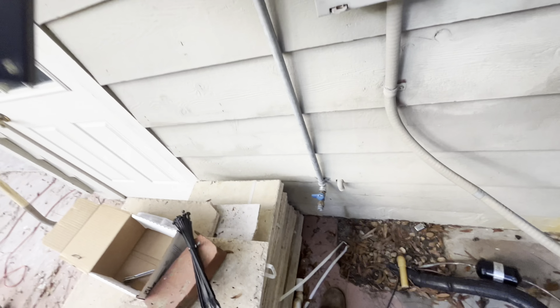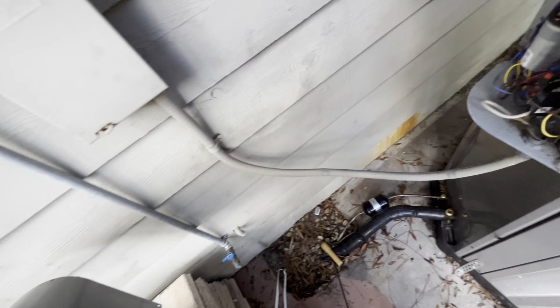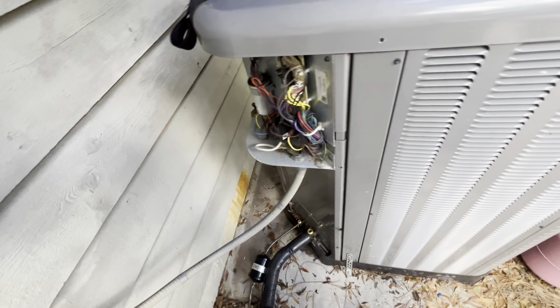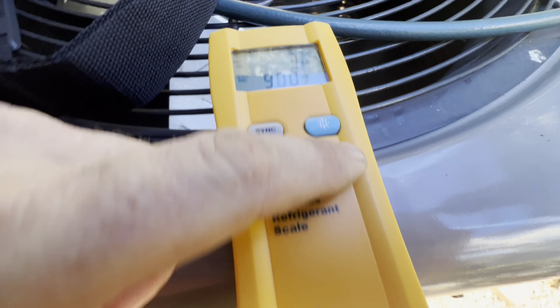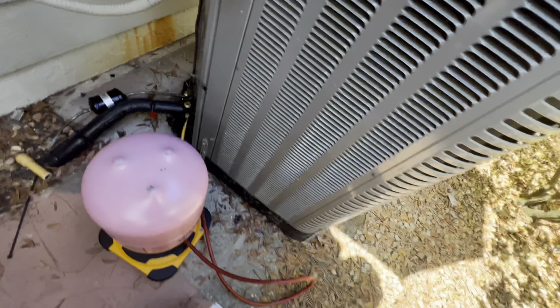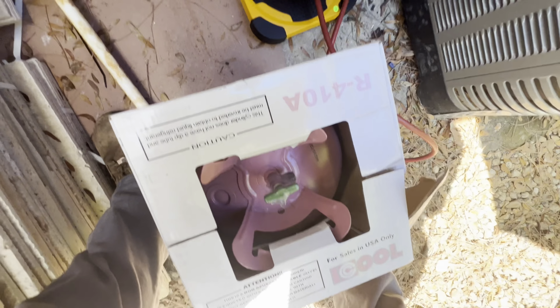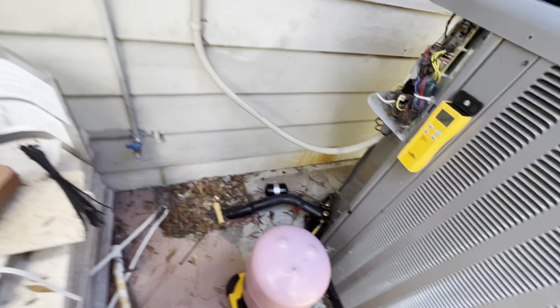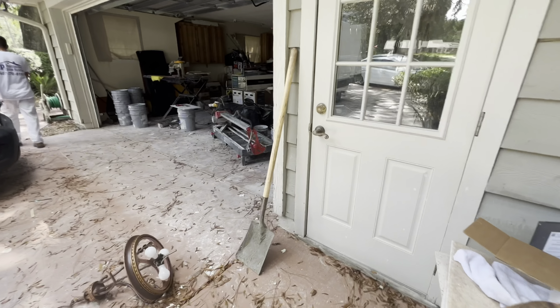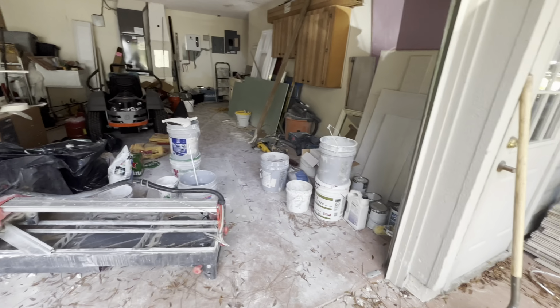We are going to do some quick math on here. We have 196 ounces. Let's divide that by 16, see what we get, then we'll weigh in our charge. All right, on the scale, we will zero it out. All right, first jug's in, 9 pounds, 3 ounces. So, gotta add, we're gonna open this one up, get it where it needs to be. Probably gonna add about 14 pounds because they're remodeling this whole thing. Come back once it's all buttoned up, kind of to make sure it's good and well.